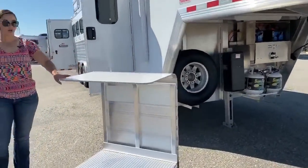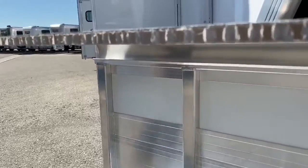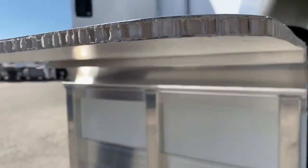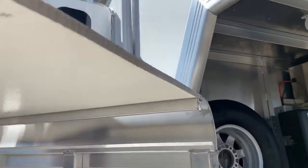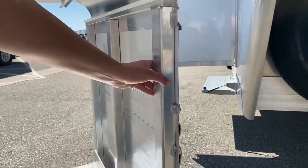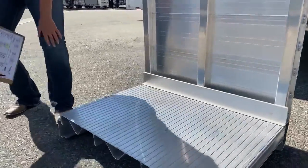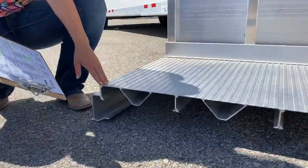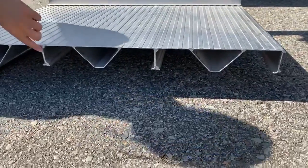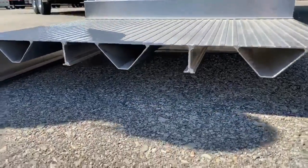This is just a base structure of a Cimarron, so you'll see the roofing right here — how it's honeycomb. It's about a half inch thick, R3 thermal values, so that roof is really nice to have winter and summer. It's going to help keep that heat in in the winter, keep the heat out in the summer, and help reflect that light. You'll see the structure of the upright posts — it's a rectangular structure that's going to make them more solid. And then the flooring has four inch centers, and the V actually provides 60% more shear force than the typical I they had before, so they upgraded to something even stronger than the original Cimarron flooring.